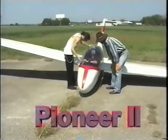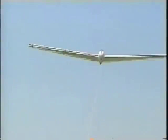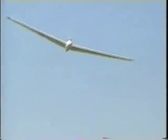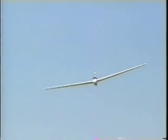Wingspan has a lot to do with sinking speed. If you have a long wing, your sink rate through the air will be a lot less. Short wing gliders never did very well because they just have too high a span loading — unless you make the aircraft very, very light. Hang gliders came closest to that, having a very light weight.